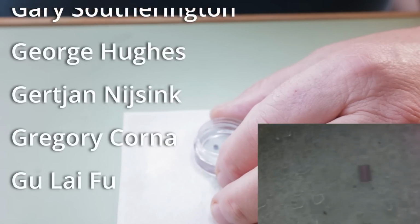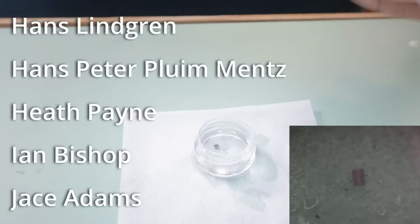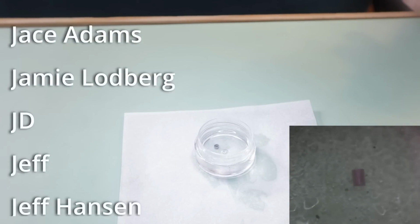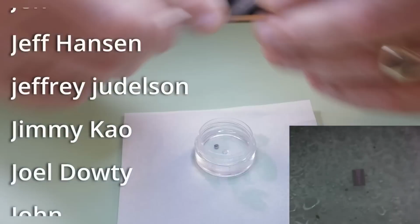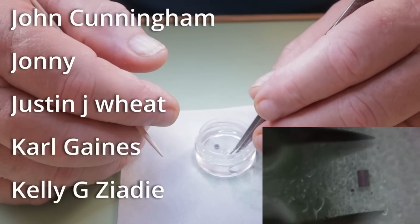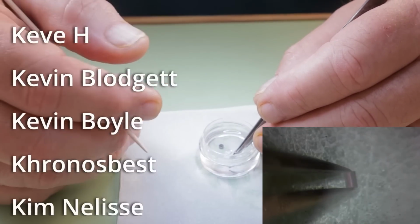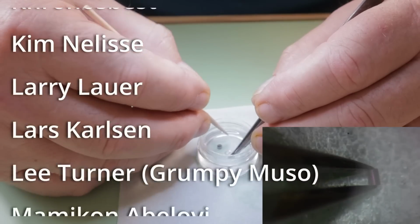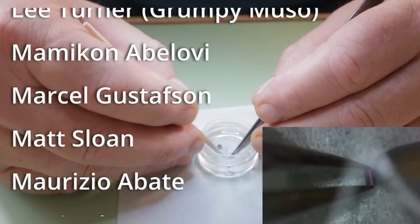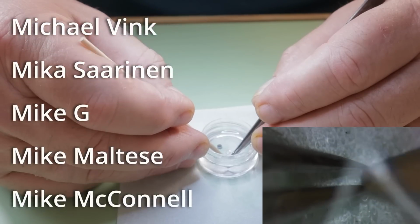So most of the shellac has already dissolved off the impulse jewel, but I'll just hold it with my tweezers and then I'll take a very sharp piece of pegwood and just rub it on the jewel. And I find that this is really one of the safest ways to do it because if it were to ping off, it's not going to go very far.